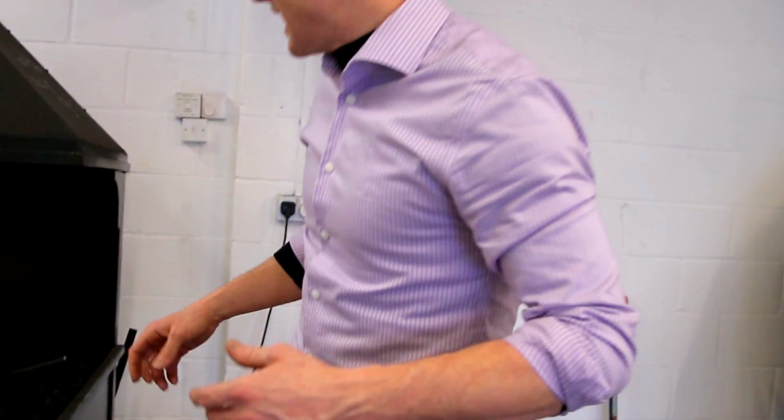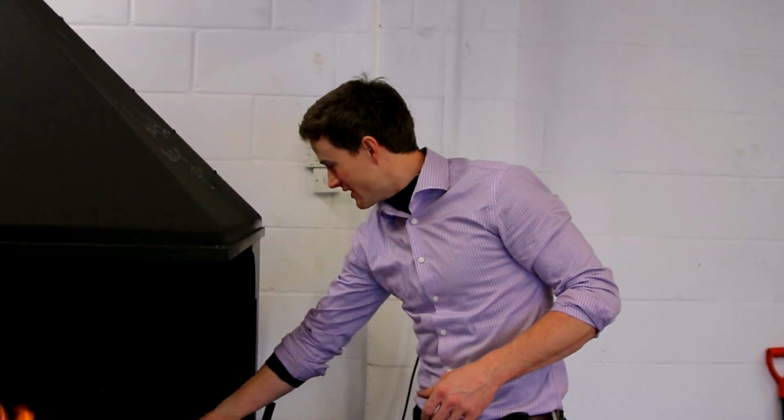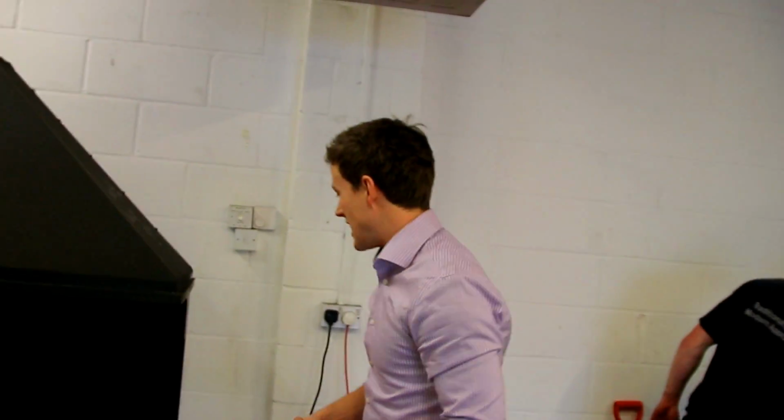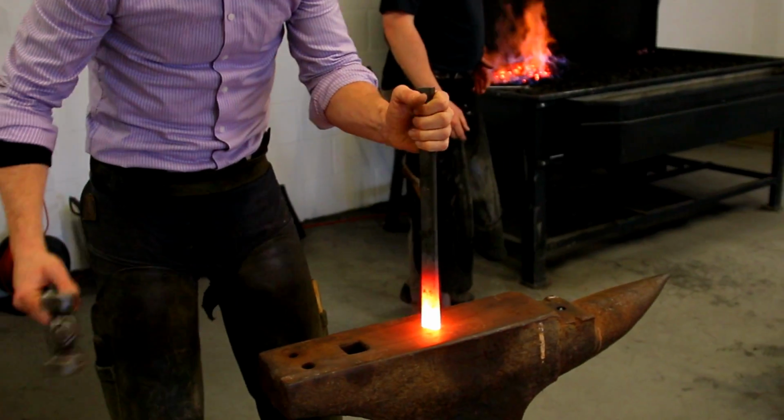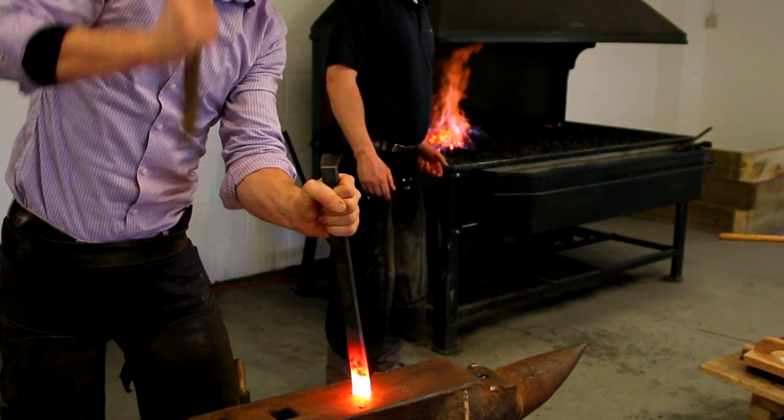So what we're going to do now is we're going to jump up our heel to start with. We want to create this onion heel, and what basically an onion heel is, it's a much wider sort of heel that covers a lot more of the bar and the heel at the same time. So we're going to bump that section, heat the bar, bump it back into itself.